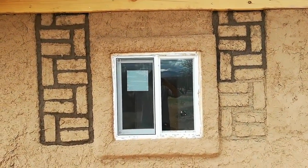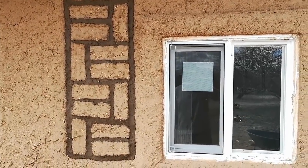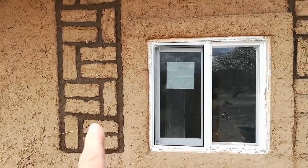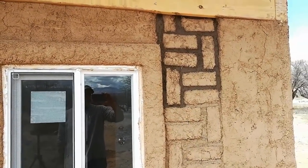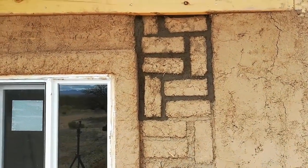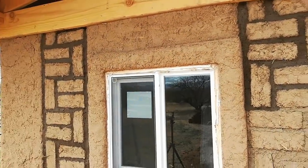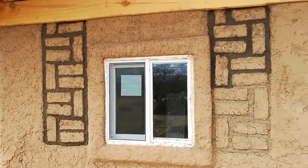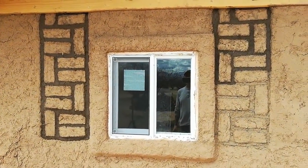Okay, so both windows are now bricked in, and I was really happy with the second batch of mortar. It was, for me, the perfect consistency on this window over here. This window where I started, it was perhaps a little loose, and I don't think it's going to have a visual difference. I think it's just going to be a personal preference, in terms of how clean you can work. Although when you look at the two of them side by side, it's really hard to tell. But how will it dry? That's the question. Will it dry dark enough? We'll find out in the next video.